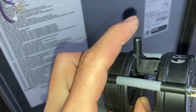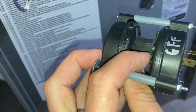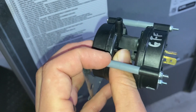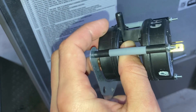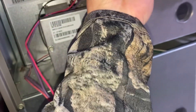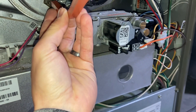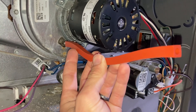When you blow into each port — so if you take this assembly part, it breaks into two diaphragms. If you blow into this one, you'll hear the diaphragm clicking in and out. This side, same thing, if you cover up the hole and blow into this port. This tube attaches to that low pressure switch, and you should be able to blow through that tube freely. You should also be able to blow into the inducer motor freely as well, mostly.